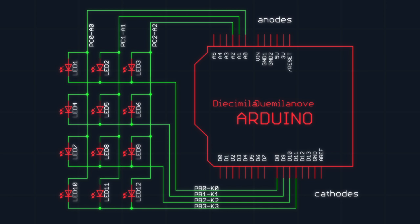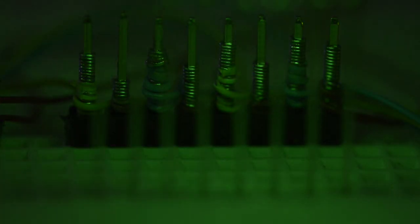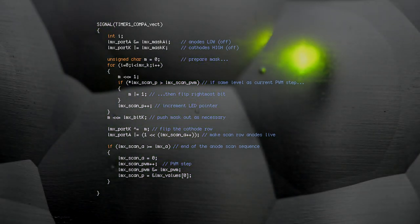So I decided to use an LED matrix. This is the schematic — I used 12 LEDs connected with anodes to some Arduino pins and cathodes to other Arduino pins, and that's pretty much it. I just had to figure out variable brightness for all these LEDs, which isn't that difficult. I used an interrupt to give me a fast timer to control my own PWM function, which can drive any of the LEDs with different brightness. Connected to that I also made animation software that makes each simulated firefly come on and turn off in a way that has a really neat and organic feel to it.